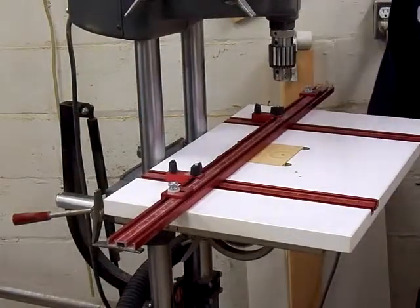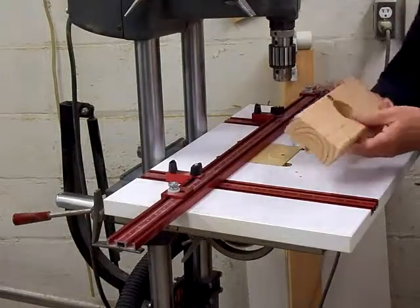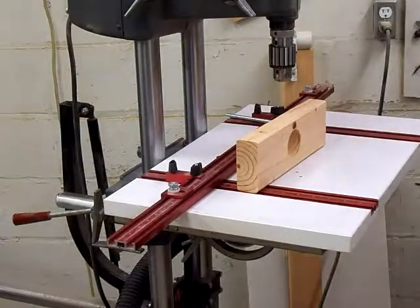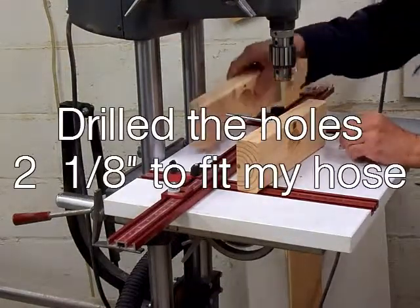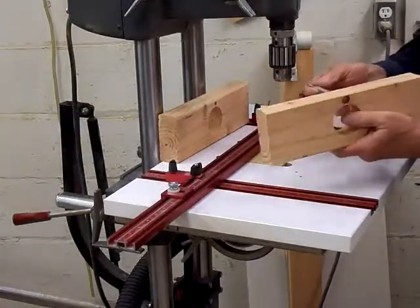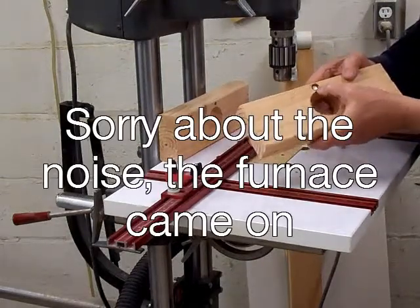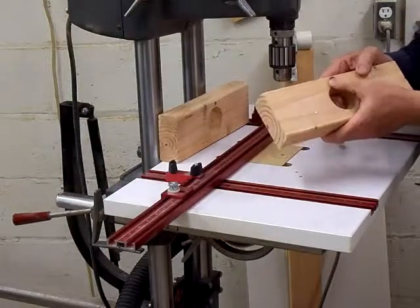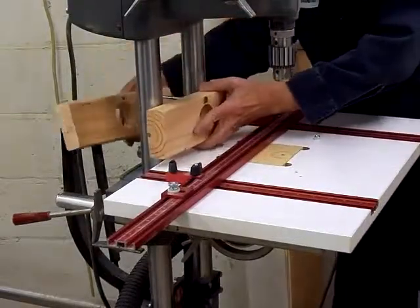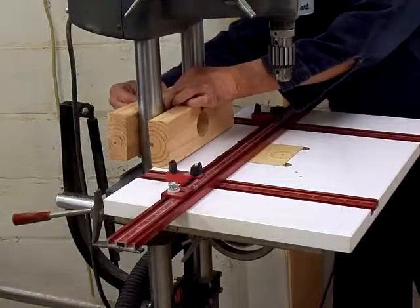So last night I decided to try to figure out some way to hold that thing. What I came up with was I had a couple pieces of two-by-four laying around and I cut two of them to fit the hose. The front one has a hole for a quarter-twenty bolt — I think that's about five or six inches long — countersunk and epoxied in place so the bolt won't spin. I just put the two together like that and put the quarter-twenty nut on there.